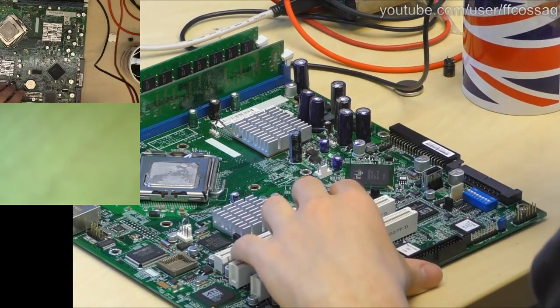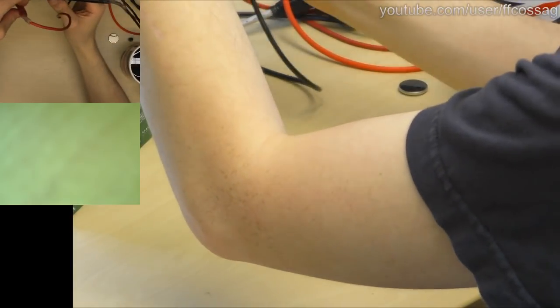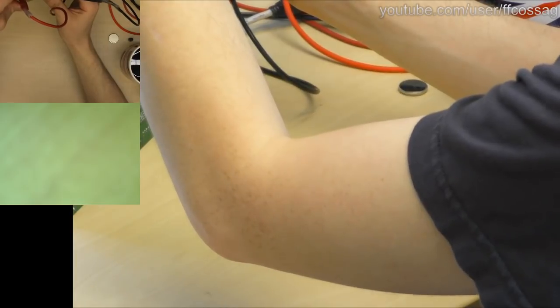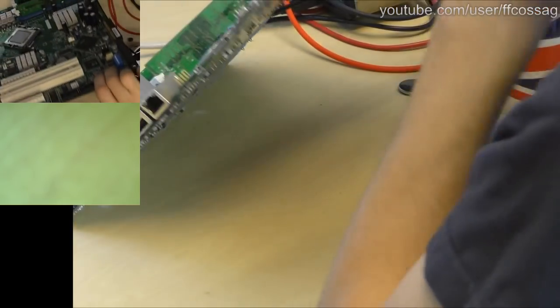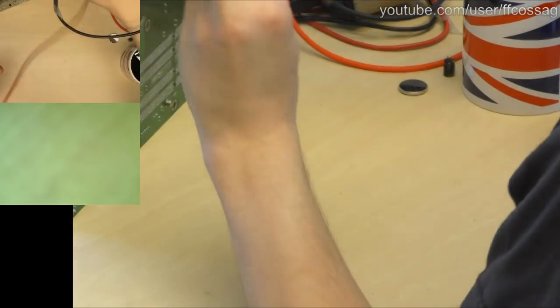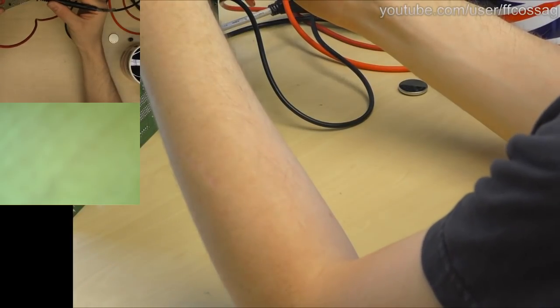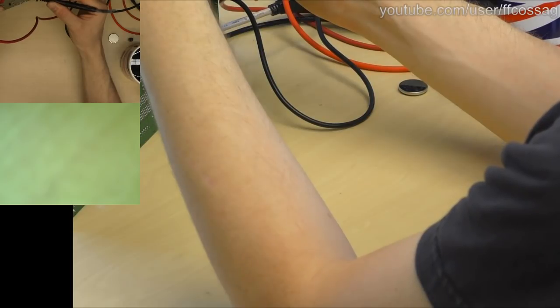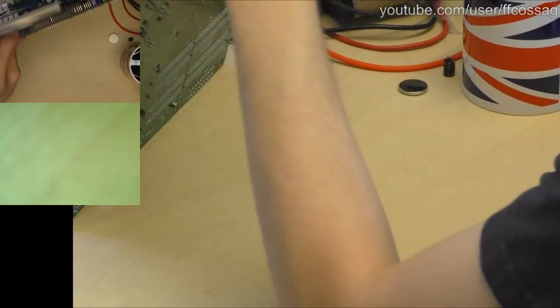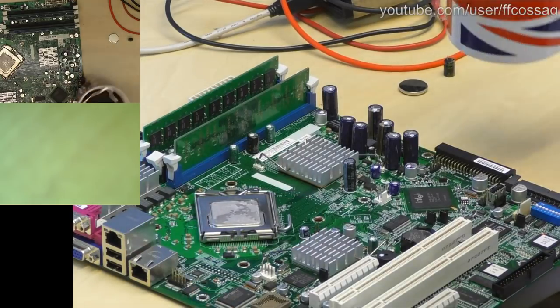So, yeah. When you have these giant banks of capacitors, they don't usually fail because the load becomes quite distributed. This has a weird cap there. Is that even a cap? Am I measuring the right thing? No, I'm not. There's a 25 volt 33 microfarad right here, and I have no idea what it does. It's weird. And it's in parallel with a million other things, so I'm sure it's fine. I'm sure this board is going to be more reliable than the consumer HP workstation we are replacing anyway.